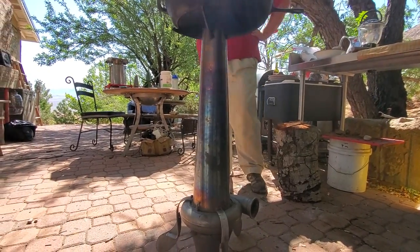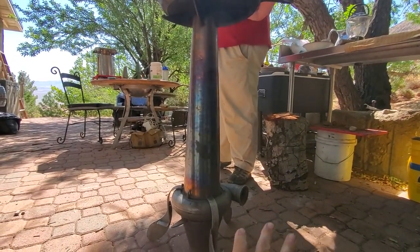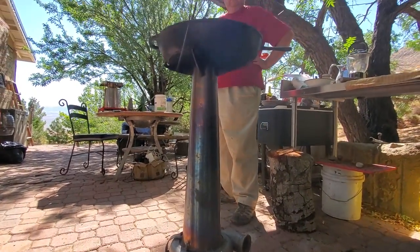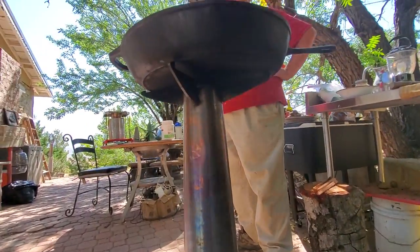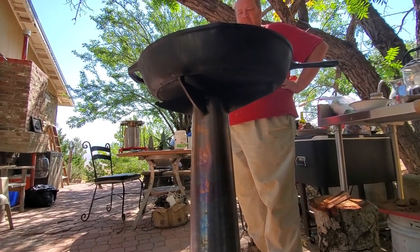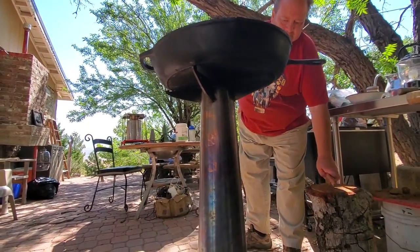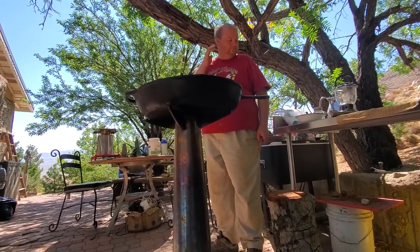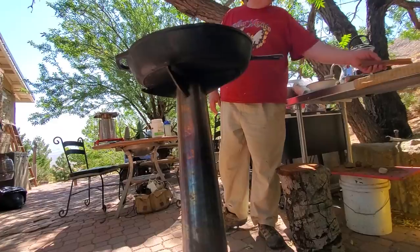The chimney works a little better with a gradual shrinkage. We've been doing that with rocket heaters, going down from an eight to a six to a four as the gas is cooling and heating the room. Ray's been doing that all along, making these things skinnier as they go up — the taper helps keep the pressure. It's cool to see it built in, rather than using a reducer with regular stovepipe, which causes friction. This is a much smoother transition.